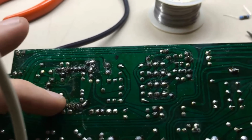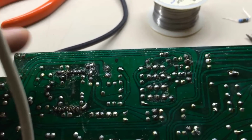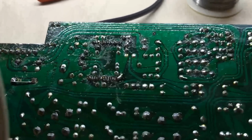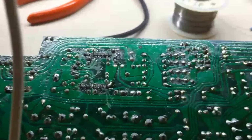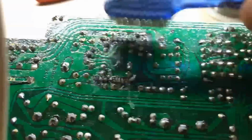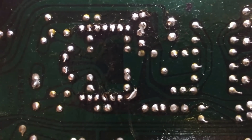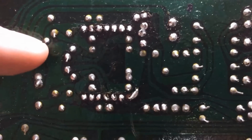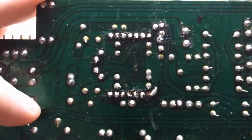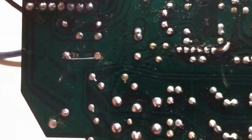So once I'd put the replacement in here, I certainly wasn't going to turn around and go back through. And you notice these things look kind of gunky around them. Well, what that is, is the rosin from the soldering. They make some stuff you can brush on here, kind of a rosin remover. Then you grab a toothbrush and kind of scrub it a little bit, and it'll all clean up nice and neat. But it's more for cosmetics than anything. I mean, you can see here it looks really good from a solder connection standpoint, and it's all held well together. You just see the crud of the residue from the rosin inside the solder. Still didn't figure out why that was done, but certainly this thing had been worked on before.